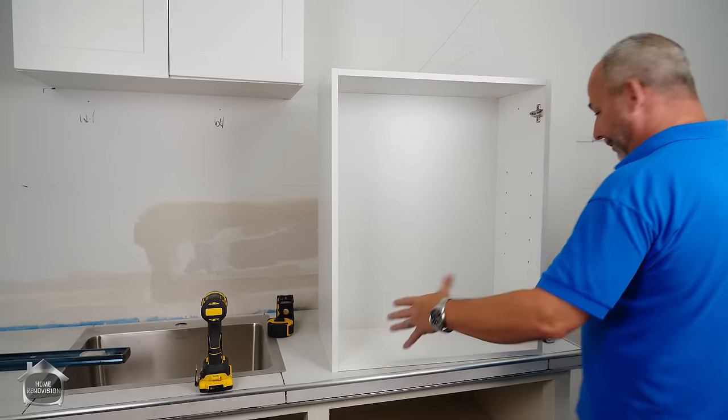The way you would address a patch all depends on what you're going to be finishing on. If it's just an open wall, you can do one of these patches. This is the good old California patch, right? You put mud on all four sides. And then take a piece of drywall out and you cut it so that it's bigger than the hole. Okay? Basically, we're eyeballing the size of the hole and we're going to scratch it into the drywall. Okay, both directions.